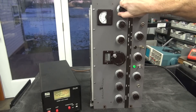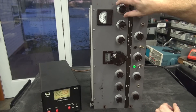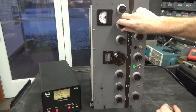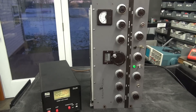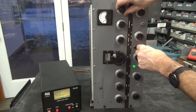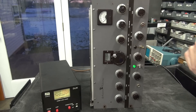Now we're in phone mode. Going over to modulation — what I'm looking for is just modulator current. It can be high, it can be low, I just want to see it. Got approximately 40 milliamps. Plate is about 230 milliamps. There's a little bad spot — it's my meter switch messing with me. I hit the switch with a little Deoxit. It's still a little flaky, could be a bad connection on the back of the switch, but I'm getting well over 100 watts and 50 to 70 milliamps of modulation current — exactly what you're supposed to have.